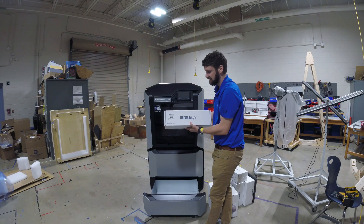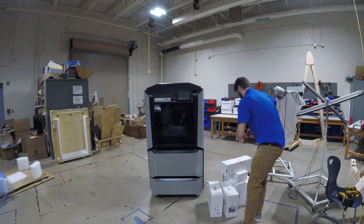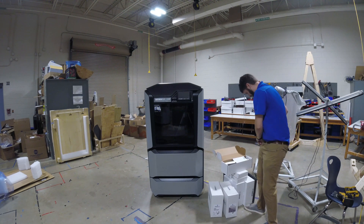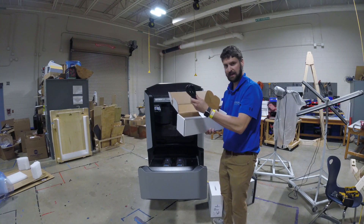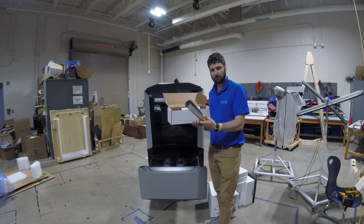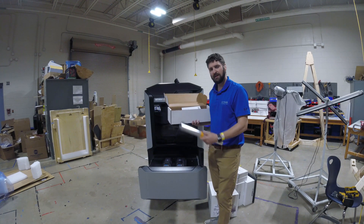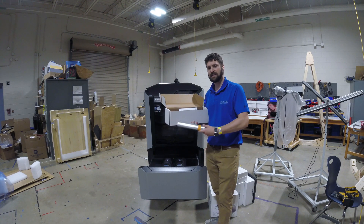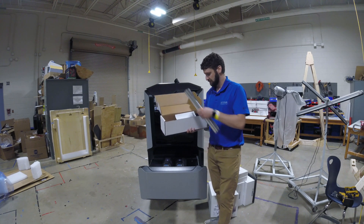The welcome kit has all our tools, power cords, Ethernet cable, USB drive, and more. Inside the box we have our power cable. There are also large Ziploc-like bags for storing material that's been opened. When you cut open a new box for the first time, if you're not going to use the material for a while, unload it from the machine and put it in one of these bags. Press as much air out as you can, or throw in some extra desiccant packs. The material has a desiccant pack in the middle of the spool, but extra desiccant doesn't hurt, especially for long-term storage.